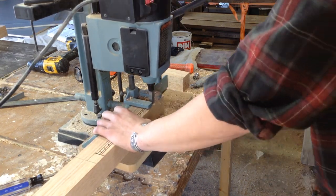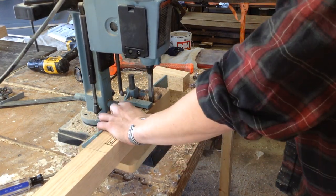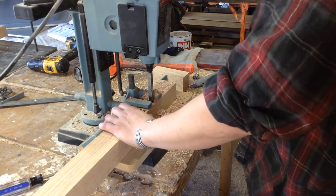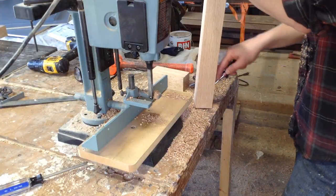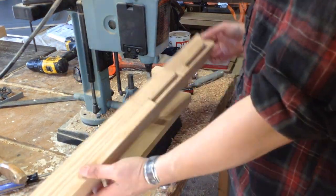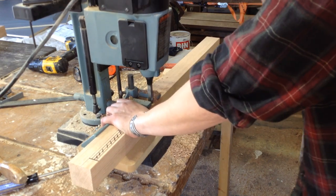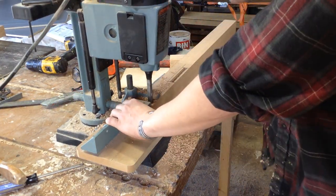For this, I'm joining all of my sides with mortise and tenon. Since the panels on this table are so long, I'm splitting up the tenons into two of them just so they're less likely to move with seasonal humidity, because the tenons are shorter than one longer tenon. You also don't have to remove as much material from the edge of the piece with the mortise, making it a little fragile on the edge — especially since the customer wants the edges all flush. The mortises are cheated pretty far to one side, so I marked all of these beforehand because the front is going to be a little bit different.